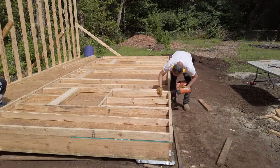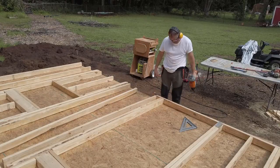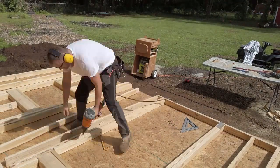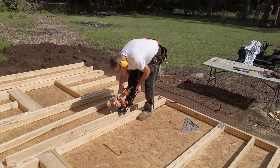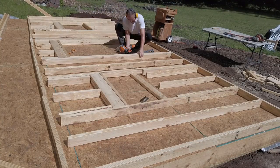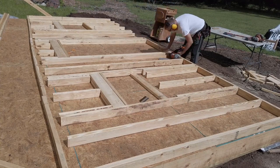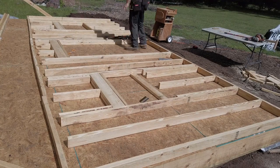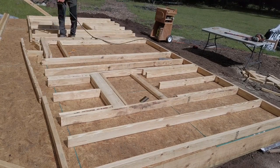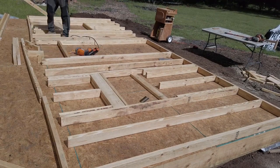This wall I've got to frame for two windows and a 36-inch door. What I like to do is mark my layout like it's a blank 16-inch on-center wall, then go back and measure out for my windows and doors. The rough openings you need to lay out for will be listed on the specific windows and doors that you plan on installing. A general rule of thumb is add two inches for the width and two and a half inches for the height. So a 36-inch wide door will need a 38-inch rough opening unless otherwise indicated by the manufacturer.